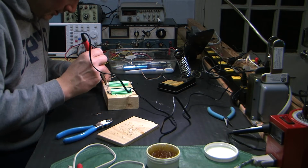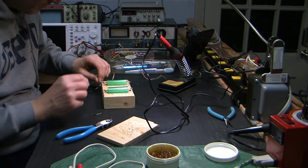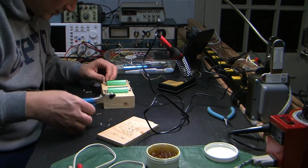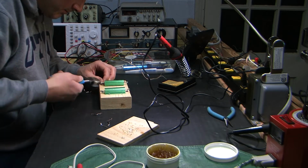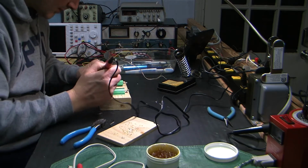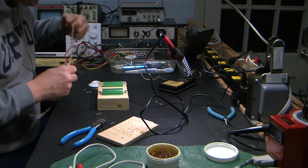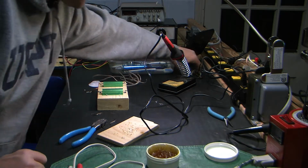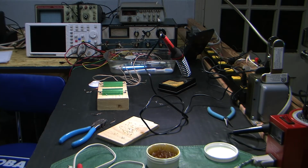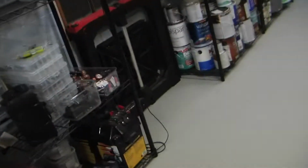So one thing that electrolytic capacitors don't like is to not be used. They want to be used. Something happens to them where the electrolyte leaks, or they dry up, and they want to have a voltage applied to them. So I'm concerned that maybe the capacitors need to be replaced, or that water infiltrated the whole thing, and so I need to check that out, and then I want to get it running again. So he gave it back to me, and I might want to use it for my drum set system, because I'm using a crummy receiver right now that's clipping.